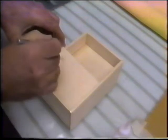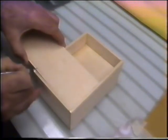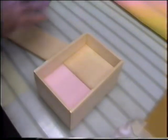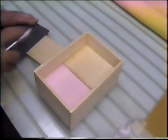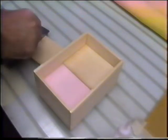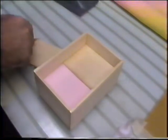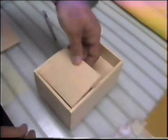The other thing I learned from actually making this mold now, and I've already put the information in my little mental bank here, is that the box has to be relatively strong. So maybe in the future we'll make that out of either thicker wood or plywood or something. If we ever do go to make the fuse mold for a full fuse, I know I'll have to make it out of very solid wood, because you're actually only using the silicone rubber as the mating surface to these parts.